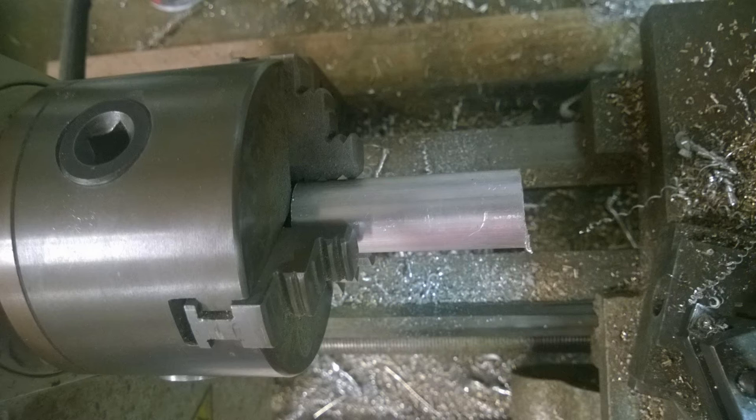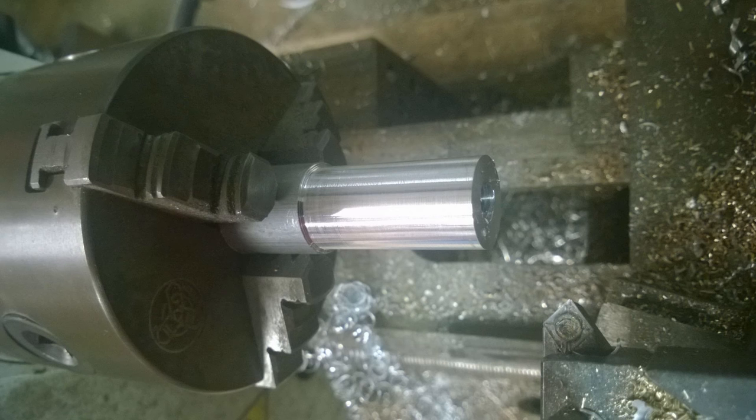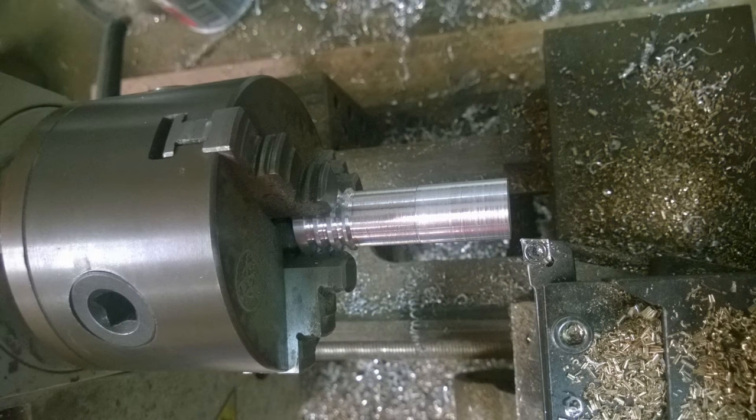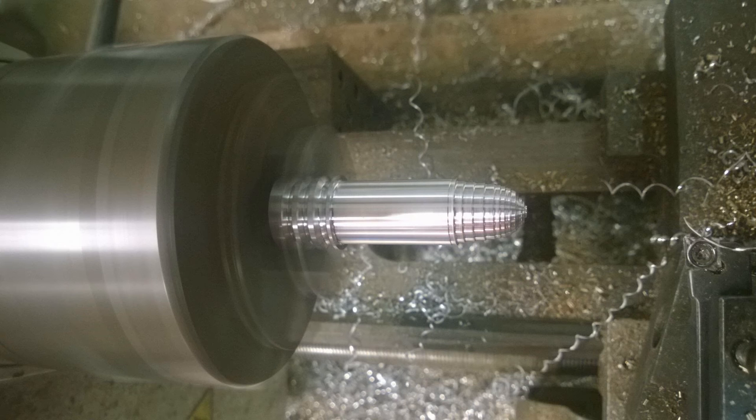For the other end of the polar axis I got another piece of round stock, did the same kind of thing — machined the OD, threaded and tapped the center — and put a few artistic little funky grooves in it. Then I flipped it around and started machining the OD, so I'm basically left with a shaft with a thread in one end and these lovely little decorative grooves. I then started to shave the whole thing down, basically just doing this by hand without a forming tool.